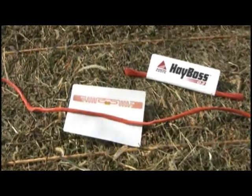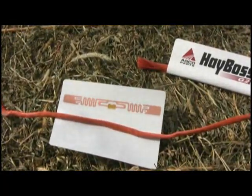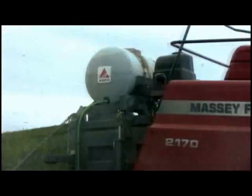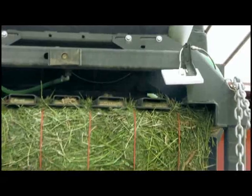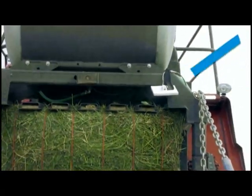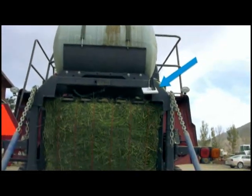the tag is closed around the twine and locked in place. There is a little memory chip embedded inside each tag. That chip has storage capacity and will hold information sent to it from the tagging device. The system is gathering information about the bale as it is being made. As the bale leaves the baler, an antenna sends this information to the tag. That information is now on the tag, on the bale, and there it will stay. The bale now has a label.